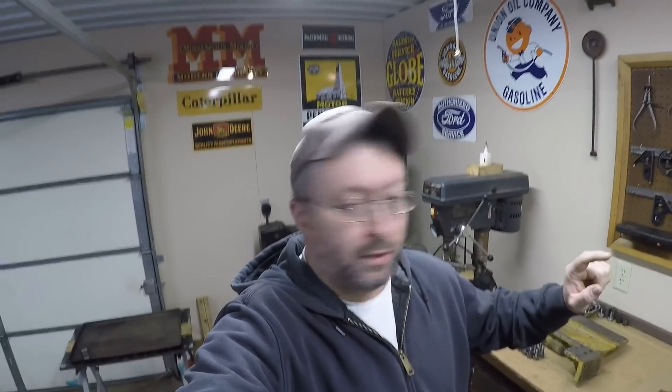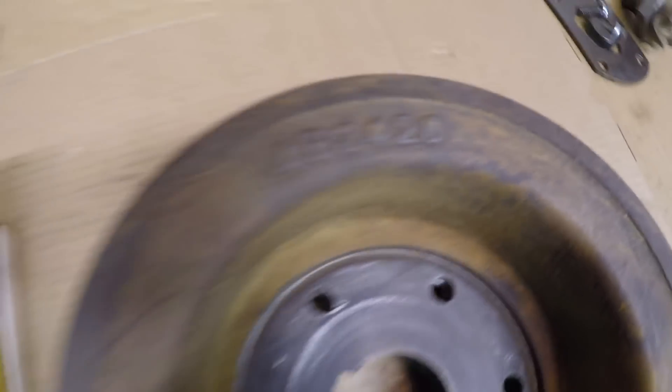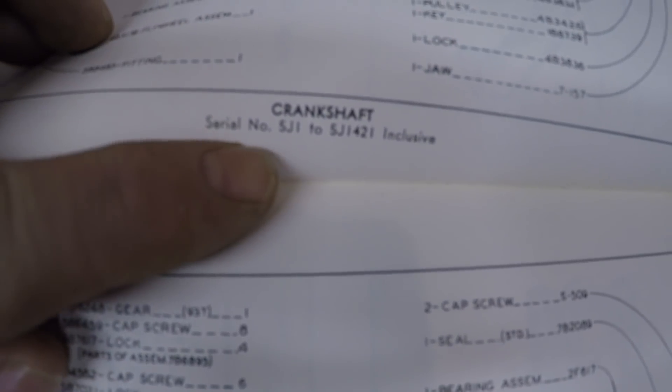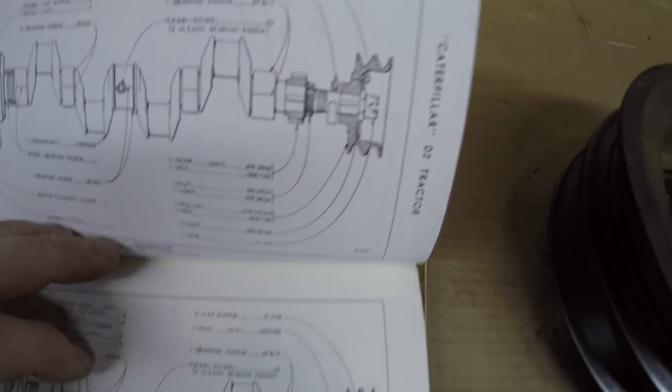It's because this pulley is some of the very early, first-generation components that were put on these early D2s, early D3400 diesel engines when they first rolled out the factory doors. A lot of these features didn't stick around for very long, and this pulley was one of them. We have the 4B-3426 casting number right here — one pulley, 4B-3426, applying to serial numbers 5J1 through 1421. That is our serial number range for 1113. We have a pulley and a standalone seal.